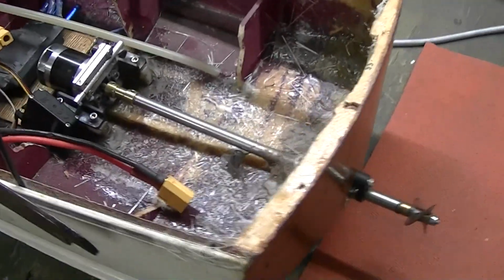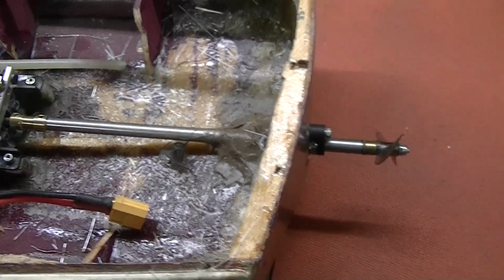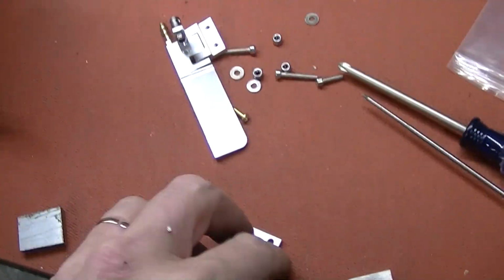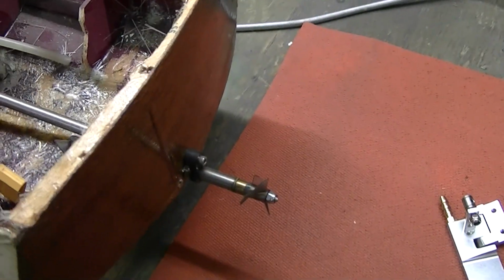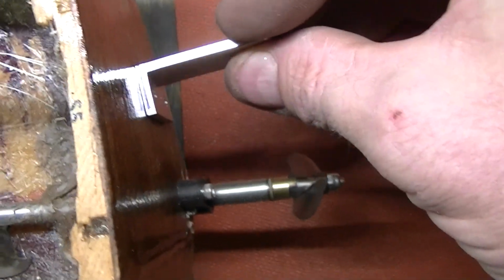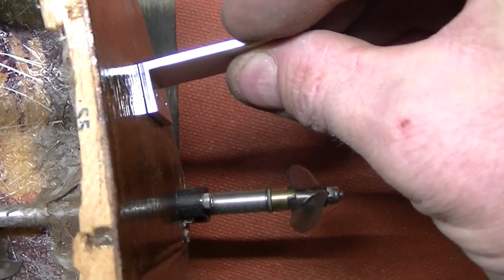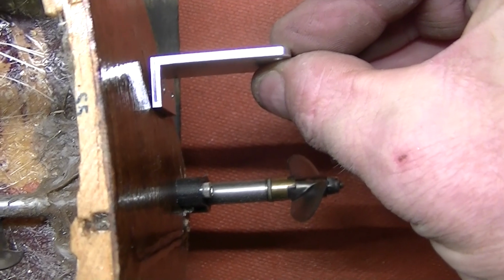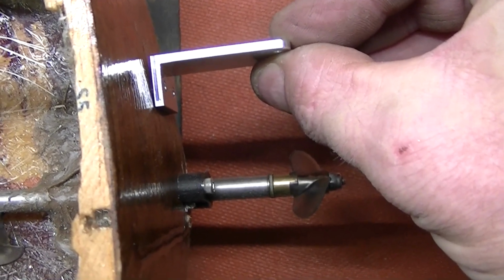Alright, work continues on the sleeper cabin cruiser. When we last left, I had glassed that in, but I was waiting for a rudder, and cha-ching, a rudder come in. But as you can see, from the top down, put that up there. See, it's at a different angle, so I need to make a little curved piece of aluminum to butt up against there.